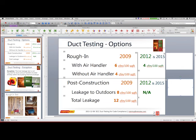Yeah, here in Georgia, they were the first to actually do duct testing and blower door. That was actually pretty amazing. And we require a compliance certificate that either goes on the air handler or in the electrical panel. It's not actually a sticker, but you could convert it to a sticker. The electrical panel can have issues with UL requirements, and it can be in the panel. Hopefully, it'll just stay there. That's always the challenge, as to where it will stay.